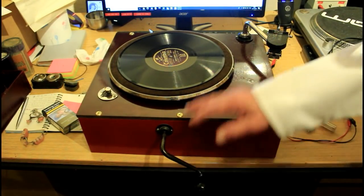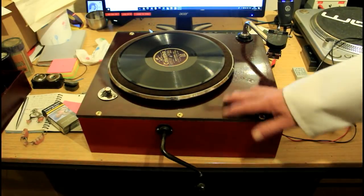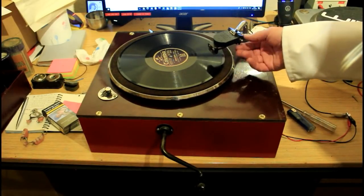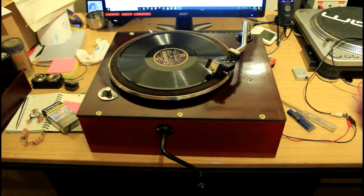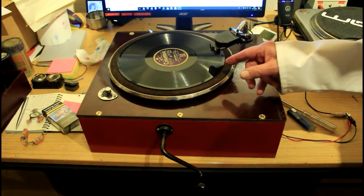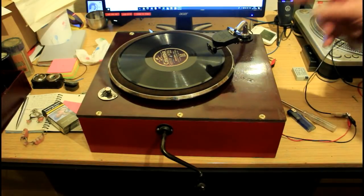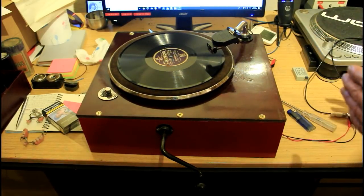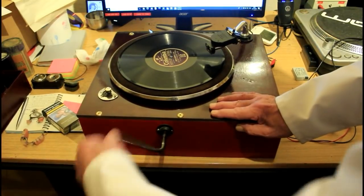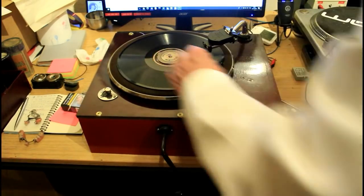Here's a spring-driven record deck — it's a Garrard Model 11, a double spring motor. This came from a 1930 radiogram. We've just got a bit of wood here and the arm, as you can see, moves quite freely. We can use it as a demonstration deck for playing electrical pickups with. We've chosen a record — I think it's 1929 or 1930: Harlem Madness by the Seven Hot Airmen, an American recording. We'll play it for you and record the sound direct onto the PC. Yes, it's nearly fully wound. We kick it in, check that it's going at 78, put it in, and we'll take it from there.